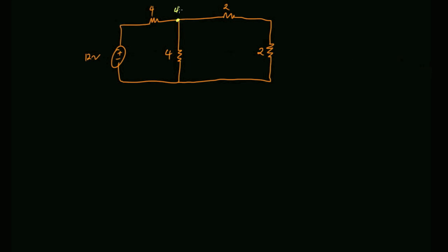So we talked about it. We said, look, the voltage divider equation appears to work on this right half side of the circuit, because I've got a supply voltage of 4. The divider is 2 over 2 plus 2, so the divider is a half. Half of 4 is 2. That part works fine.